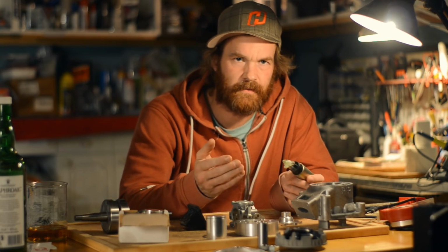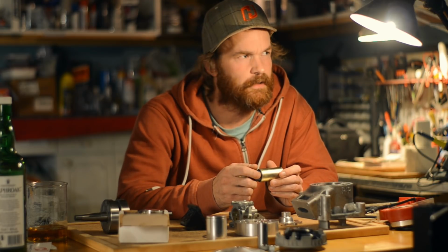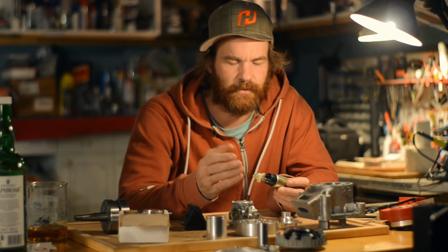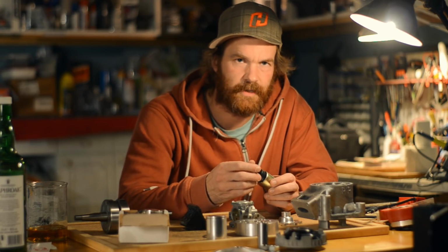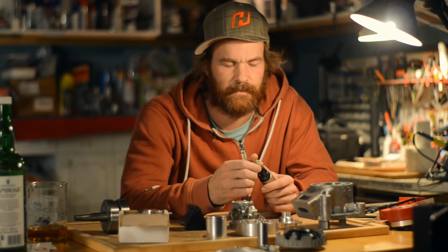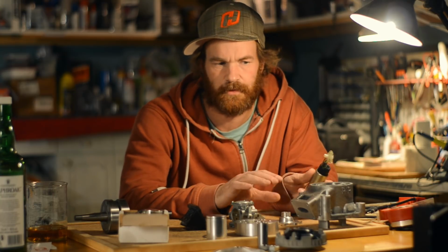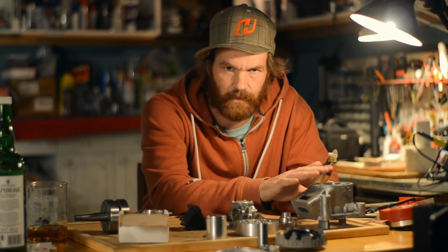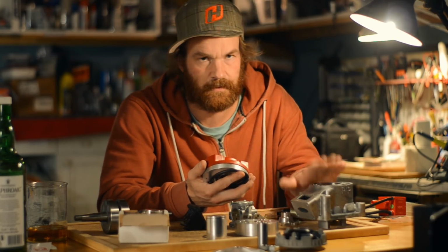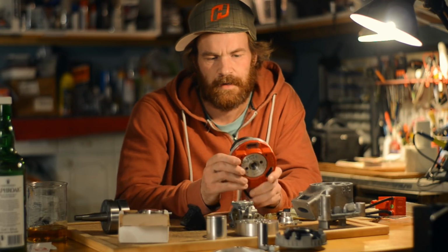So it's kind of like the old mechanical injection, but electronically controlled. Continuous injection, so no pulsing like in injectors, because that's the problem with normal injectors in such a high RPM two-stroke engine. I need a lot of ignition power with the nitro and the methanol and nitro fuel.